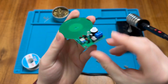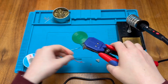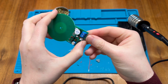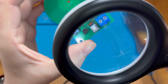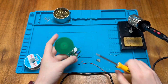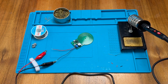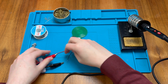Hopefully that's all assembled. I'll need some power leads, so I've grabbed two bits of wire and popped them in the terminals. The board says it should run from three to five volts and the positive is on the left. I've set my power supply to four and a half volts. Let's connect up these leads and see what happens.